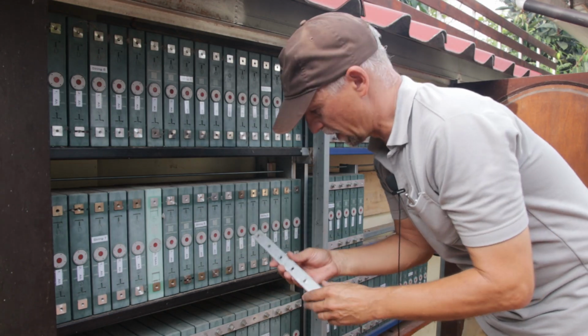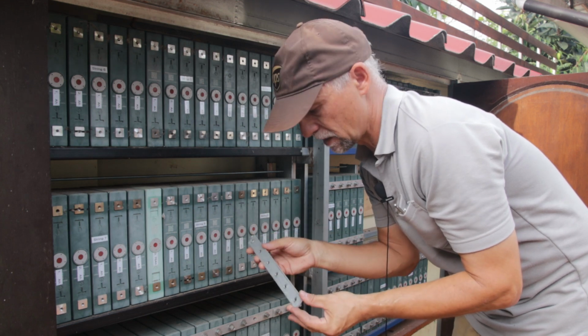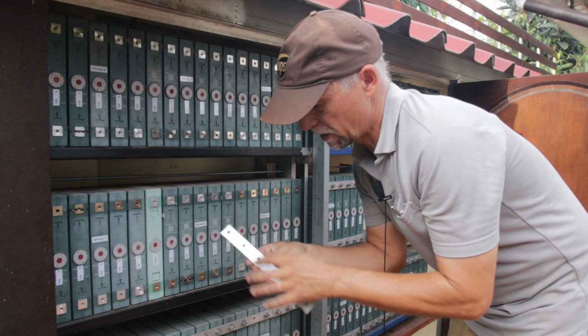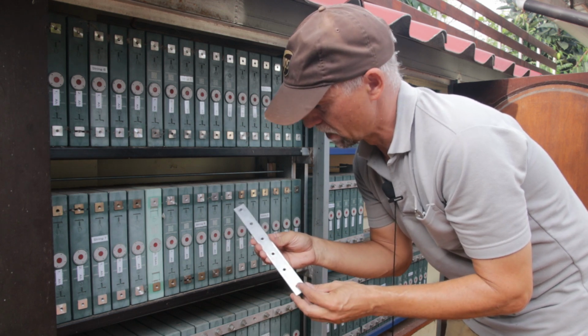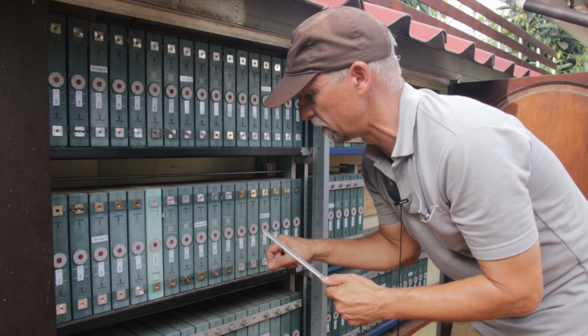Just a word to the bus bars, right? As you might know, I was really just using simple aluminium bars. These were about 50 square millimeter, and if you look at the bus bars, there's no corrosion at all. So even though we are here in the tropics in a harsh climate, this held up very well. And the battery terminals anyway are also aluminium.